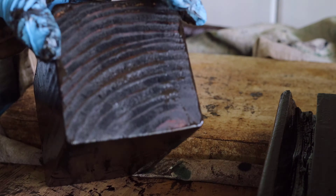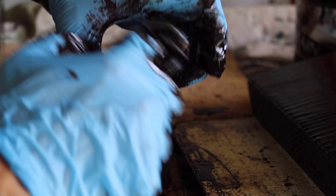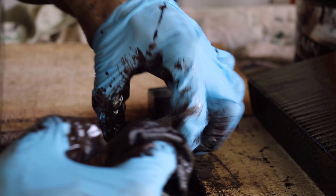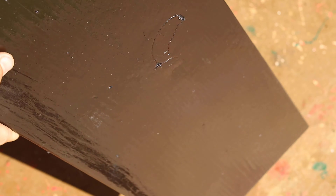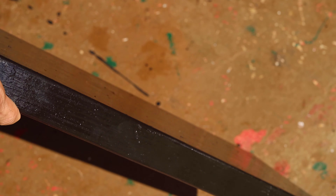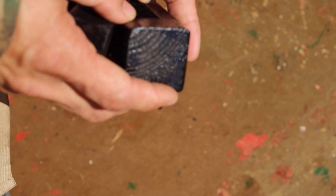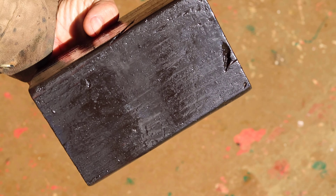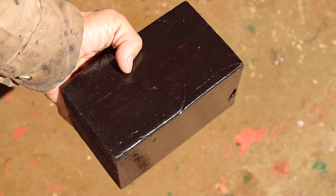Along with the tint of the finish, I also wanted to see what would happen when applying these finishes with a shop towel rather than a brush. The polyurethane, like the stain, went on easy with the shop towel. The advantage is that it's cheaper than a brush, but the disadvantage is that you use a lot more of the material. Overall I was still satisfied with the result. Even though it ended up not showing the wood grain, I still liked it because it was dark — in fact so dark it was as opaque as paint. The color ended up being a very dark brown, so even as a paint alternative it has a very unique color. There are no clear advantages to doing things the wrong way, but overall this was a quick and easy process. I would do this again if there were other scrap wood pieces that just needed to get covered quickly with color and aren't the focal point for fit and finish.